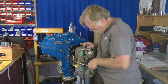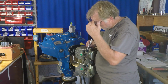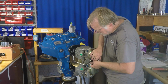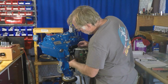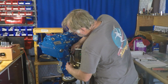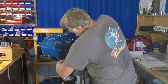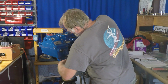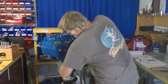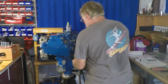So we're tightening these up, and then we're tightening the cylinder side up, and then we'll come back and tighten up the Jubilee clamps, or the hose clamps on the lower end, and we're putting a Torque seal on there. What we did here is tighten it till it snugs, and then one flat. That's kind of an industry standard thing, and on the B-nuts. And you can see we're tightening these so you can access the clamps from the front of the engine. So we're assuming the engine has the induction system on it. It's got the exhaust system on it.